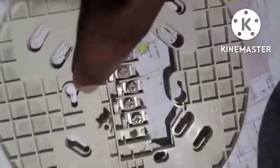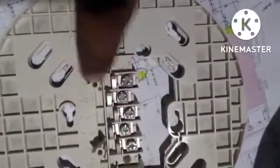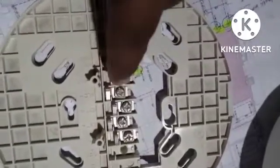For the sounder base power cable, connect the EXT minus (negative) cable here, and EXT plus is the positive cable. SLC minus and SLC plus are the loop cables coming from the panel or from the previous device.